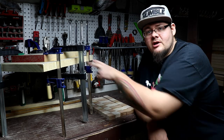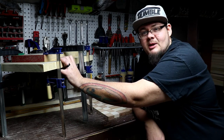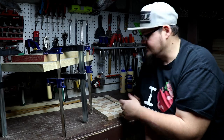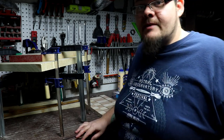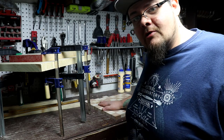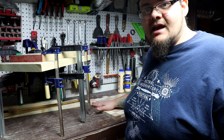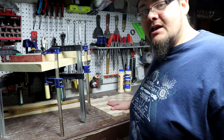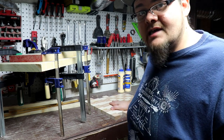That's pretty much all we're gonna do today. I forgot the parchment paper upstairs — I'm going to put a piece of parchment paper between the wood and the board when I glue it up so the glue doesn't bond the pieces together. If the parchment paper does get glued to the board, no problem — we just sand it off. So I'll run back upstairs, grab the parchment paper, and we'll get all these strips flipped the right way and get them glued up. We got our parchment paper and all our strips including the one extra. I'm going to go through, flip and rotate them, figure out which eight look the best, get rid of the one I don't need, and line up the grains for the best aesthetic. Then we'll get them flipped and glued up, and tomorrow we'll work on the sanding.